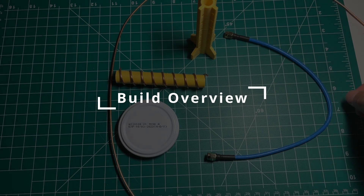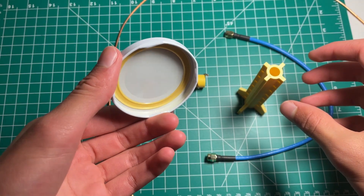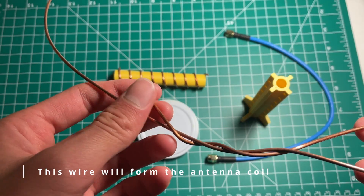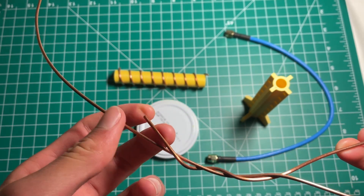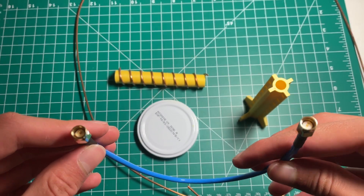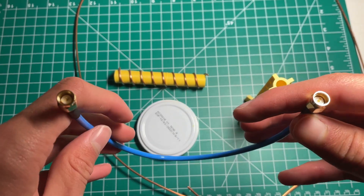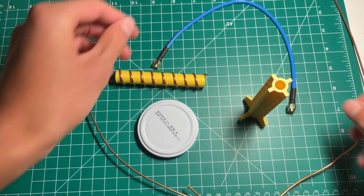Today I'm going to make my DIY helical antenna. This old glass jar with a metal screw-on lid will be the reflector for the helical antenna. I went to Home Depot and picked up 12-gauge copper wire at about 25 cents a foot. To connect the antenna to my goggles, I bought this male-to-male SMA to SMA connector. I can cut this connector in half to get two antennas without having to solder individual connectors — the cable is included too. That's my tip for saving money.